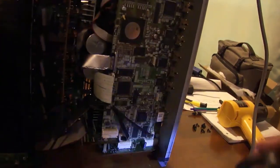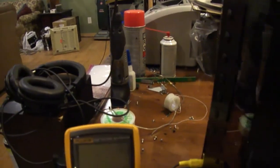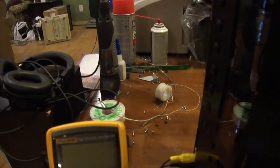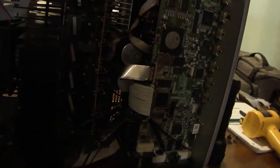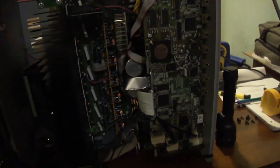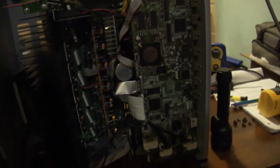So yeah, but now I bet you, since this is cooled off, turn the power off, turn it back on. Nothing. Oh, no, it loaded. It just took a very long time. So it's getting slower. Cool. Now that the board's warmed up from operation, that's probably why, as I've read in some forums, after it's on for a bit and you do a couple resets or whatever, it suddenly starts working again. Well, that's why. Because when you turn the power on, all these components start heating up from voltage and current flowing through them. So you're chasing a red herring, but let this thing cool all the way down, it won't work again, I guarantee it.